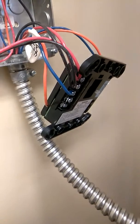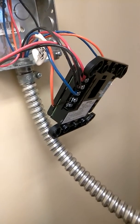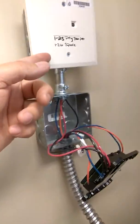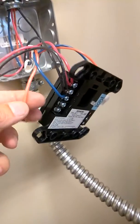The ground fault went away — confirmed. So then I put my meter to the individual legs of the individual zones to see. I had one leg of my meter to the lug and came down and stuck the other leg to a good ground source. Had it set to ohms until I found a dead short. The dead short was on this orange one.